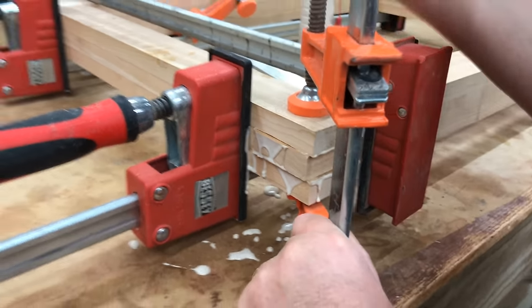And these are going to be the dividers for the cabinet. I'm going to have cabinets on either side. I'm ultimately going to put drawers in, but I do want the ones on the left and the ones on the right to be the same size. So I'm going to use some spacer blocks here that give me exactly equal positioning, so that when I actually make the drawers, the ones for the left and for the right can all be identical, and I don't have to make individual drawer sizes for each side. It'll be a little bit quicker to do it this way since I can cut them in bulk.